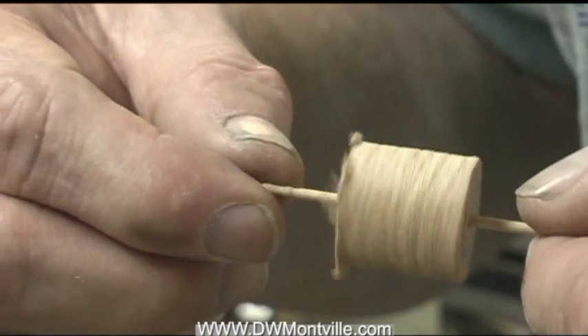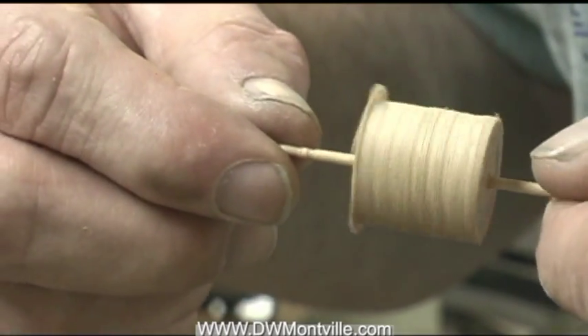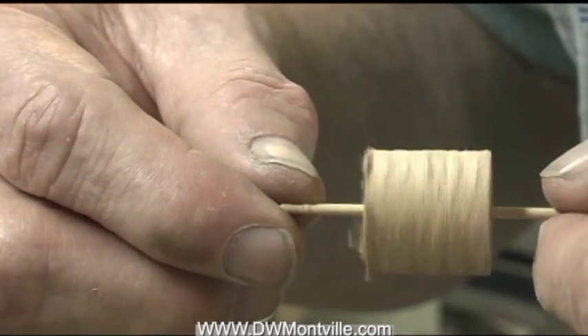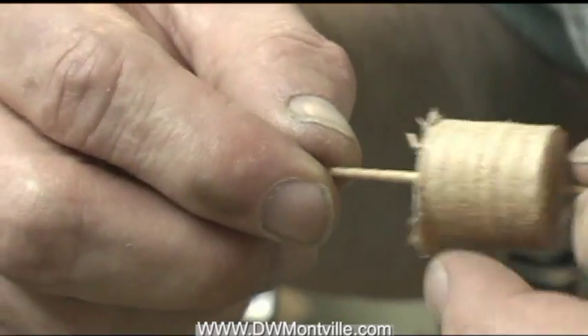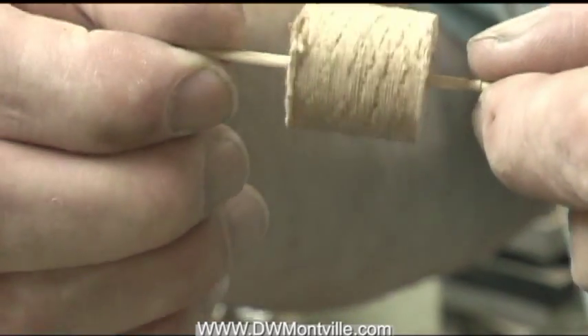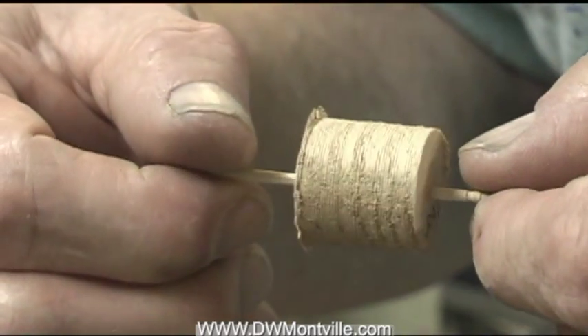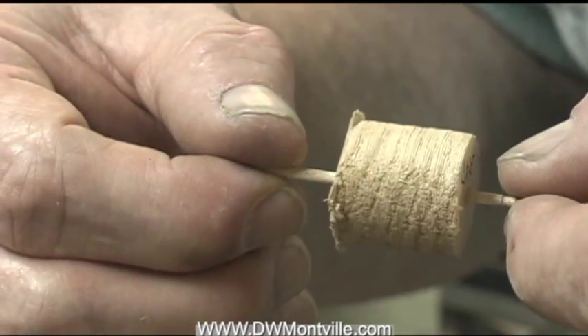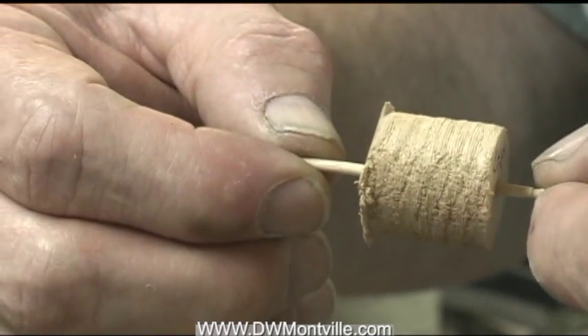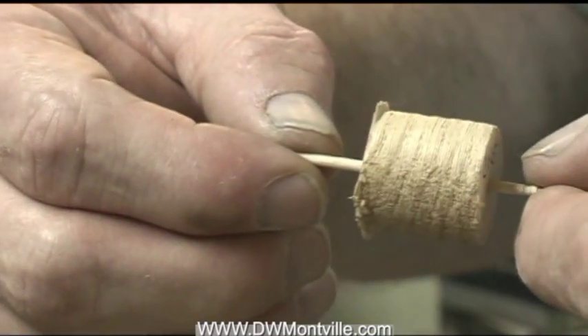Here's a waste block that's really well drilled — you can see when I rotate it, it runs nice and true with no wobble. As opposed to this one, which has a lot of wobble. If I were to put that on the tool it would run out, it would not carry the center well, and the tool would not come out right.